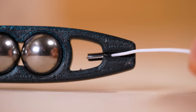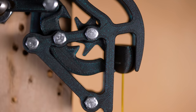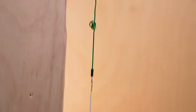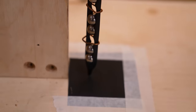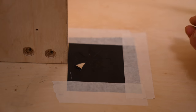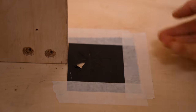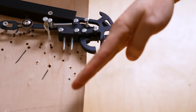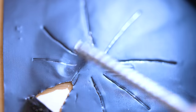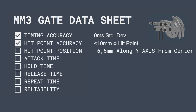Let's look at where the marbles are hitting in relationship to the gate. I made a plummet — I can 3D print a sphere with the string coming out perfectly from the center, attach the sphere up in the gate, and run electrical cables all the way down. I make scratch marks showing where the center is, drop it from the gate, and I can see the dent in the paper where it hit. This is designed at a 5 degree angle, angled backwards, throwing the marbles in that direction. Shining a light from the side, we can easily see where the marbles have been hitting — from an imaginary center point, the marbles are hitting a point 6.5 millimeters from the center. Check.